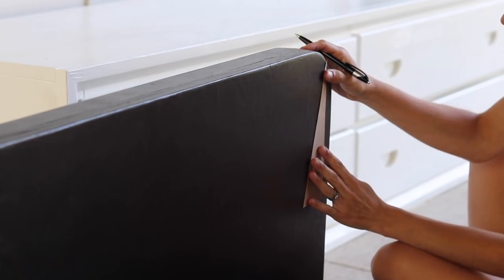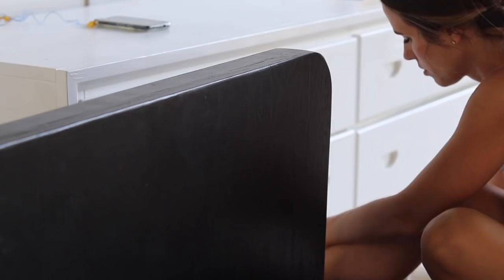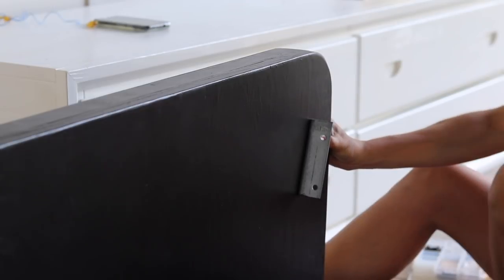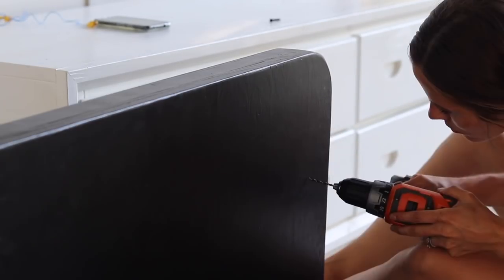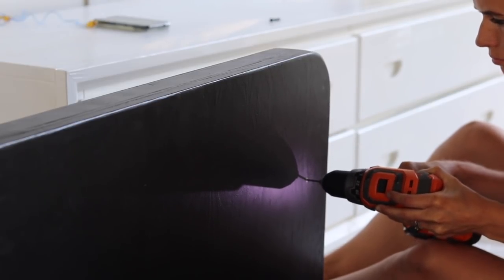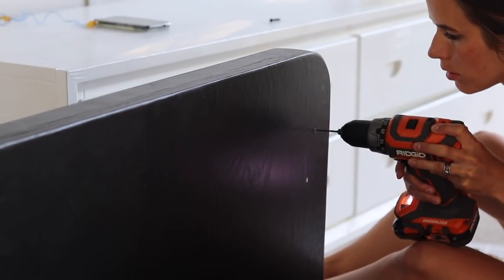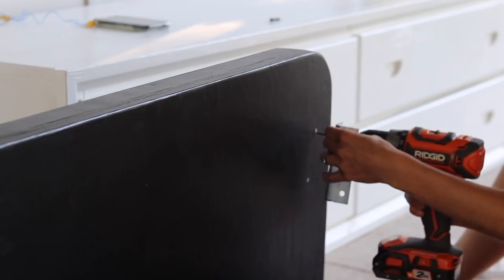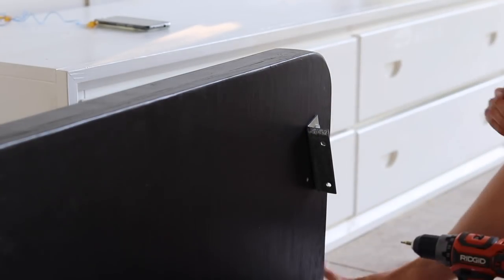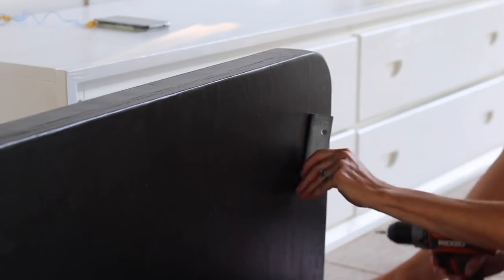When all the paint was dry, I used a cardboard cutout because I had an angle in my head and wasn't sure how to get it — this is to mount the back piece on my bed swing. I did this on both sides, and then I used a stair stringer — a big metal piece at a 90-degree angle with four holes for four screws. I actually cut mine in half with my angle grinder because if I left it whole at about six inches long, it was just too long for my application and would stick below the back. So I cut it in half and installed that.